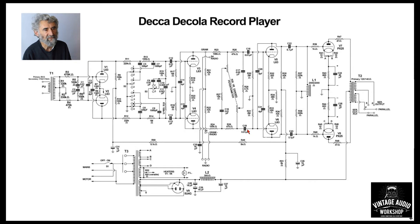Again we have a balanced pot across here which looks like a tone control but must actually be the volume control. We couple into the driver valves, again with the so-called neutralization, to help balance the circuit. They have separate cathode resistors that are then joined together and go through a common one, applying negative feedback. Although this amplifier is described as having no negative feedback, that isn't true — not bypassing these resistors constitutes applying negative feedback. It also increases the output impedance of the valves and makes them more susceptible to hum, which isn't ideal. The stage then drives the final voltage to the grids of the PX25s.